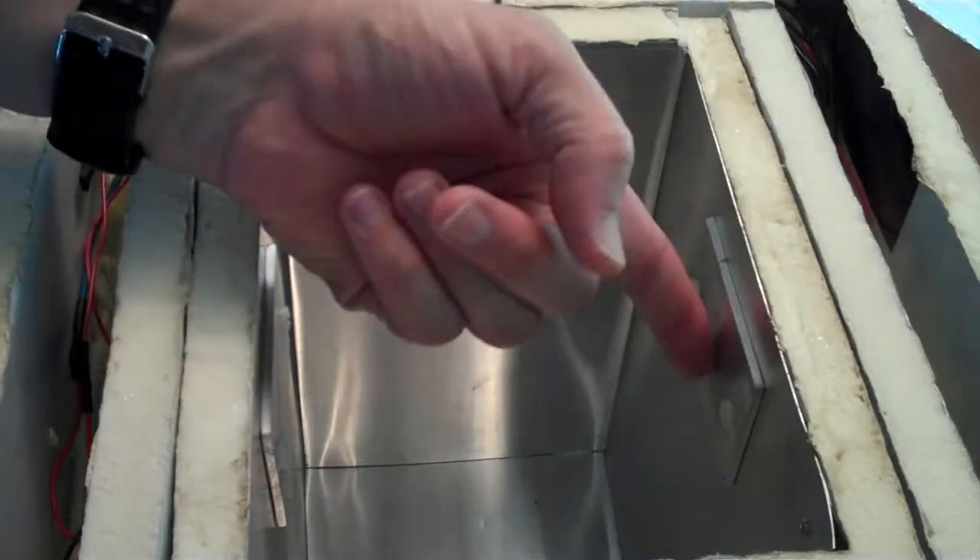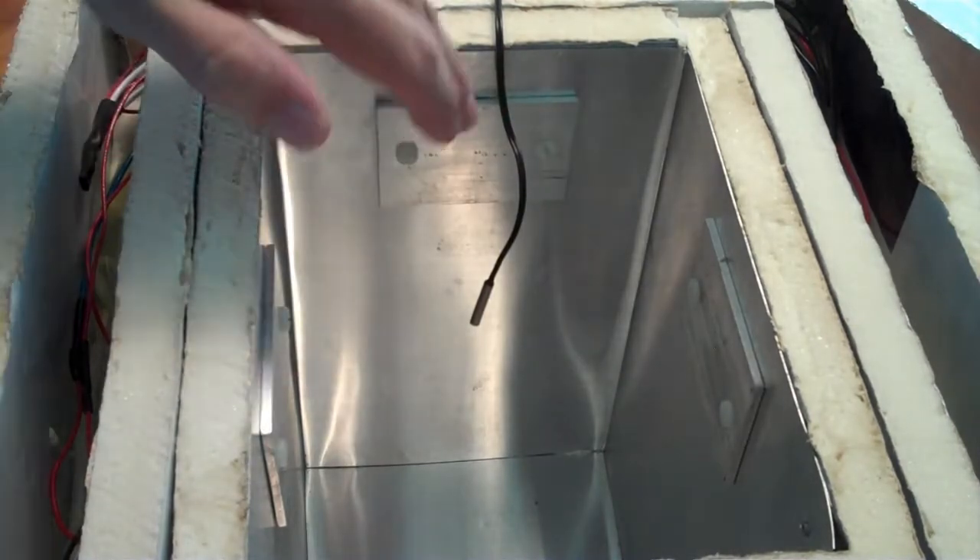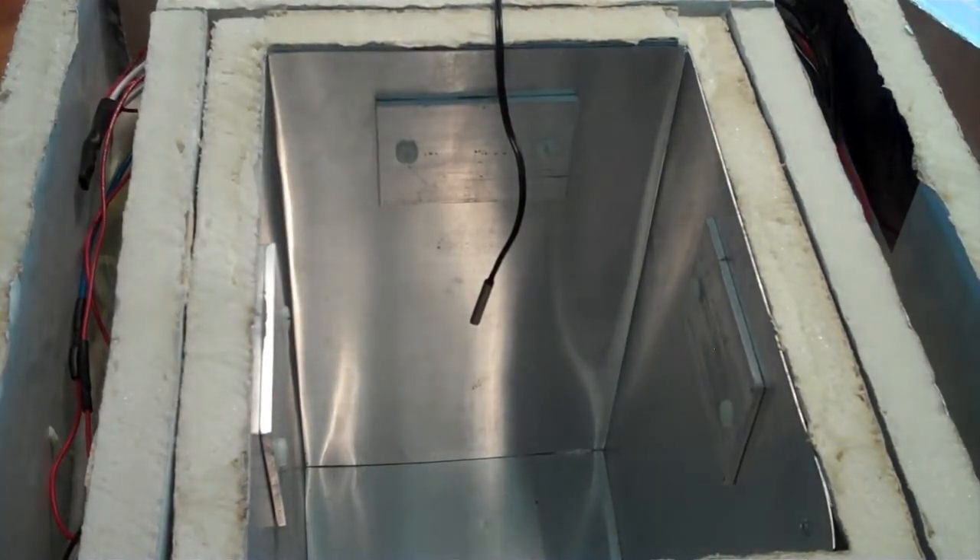I'm making this video so you can see how I built this and what design decisions I made, and hopefully it will be helpful to somebody else interested in playing in this space. This cooler has an interior volume of eight by six by ten inches, which is 480 cubic inches or 7.8 liters. The refrigeration area is about half that of the smallest commercially available car coolers that use a compressor refrigerator — about 0.27 cubic feet.